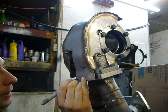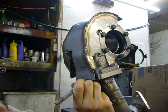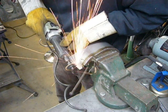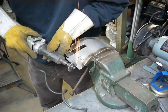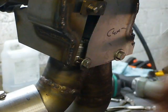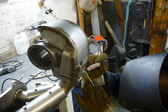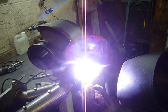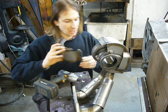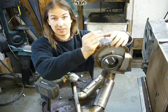Make some marks for the lower mounting holes — one about there, and about there. I'm just going to make two notches. I'm just going to pass these washers into place so I don't have to fart with them while I'm trying to install this thing on the car. The space is very limited and I don't want these washers falling off. The second half of the heat shield got exactly the same treatment with the lower mounting holes, and now I can just bolt it into place.